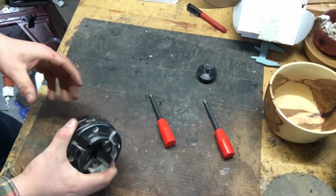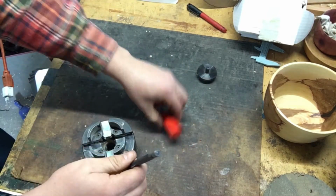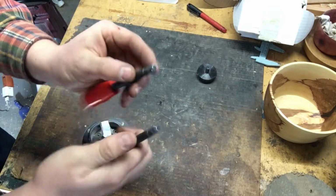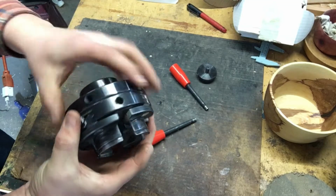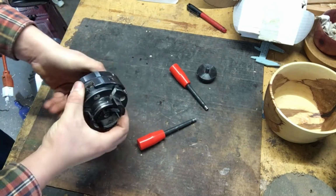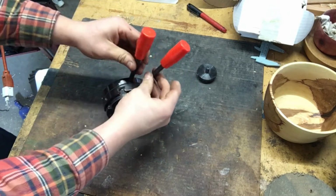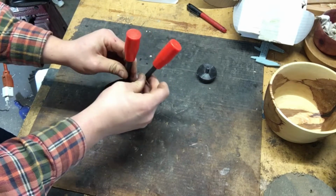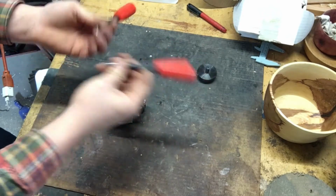The only wear that you can see on this chuck after 30 days is on the end of these turning pegs. You can see how the ends are slightly rolled on both pegs, as well as the corresponding holes in these collars have some elongation. That's partially my fault, I think. I notice it slip sometimes when I don't consciously push them down into the holes and make sure they're fully seated. It's important to have them all the way in there so you get the maximum surface area.